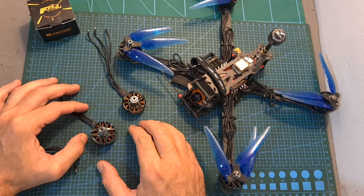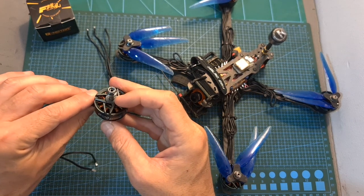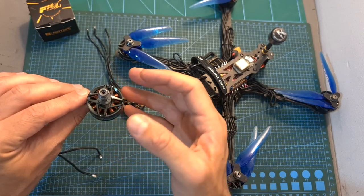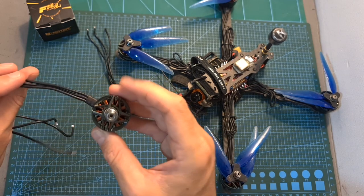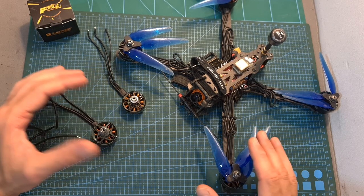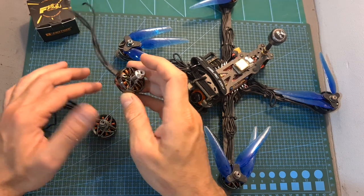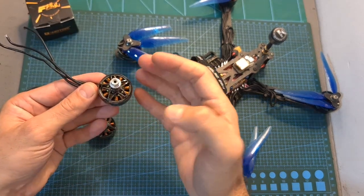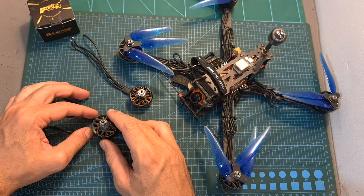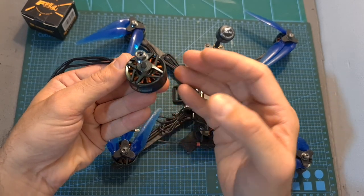Overall, after testing it out, I can tell you that even though originally the F100 motor is intended to be used on heavier X8 single lifters, which unfortunately I still don't have, it can still be a pretty good option for 7 or preferably 8 inch builds, as it is pretty powerful and efficient, so it can be a good upgrade over a 28-7 motor, as according to my experience, it is going to provide you with more power, but still remains relatively efficient.